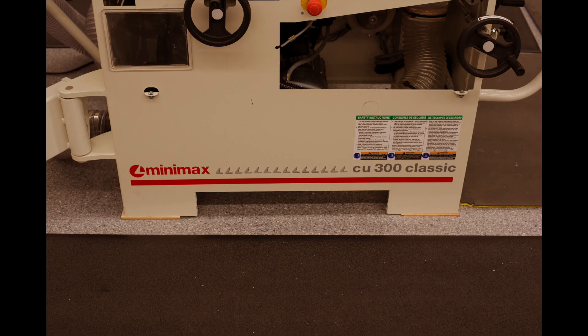The first step in the process is to get a general level of the machine, and with that I use the large construction grade level to prop up the corners of the machine. For this particular leveling I used shims of plywood, hardwood, and some thin slivers of pine.